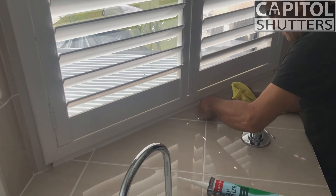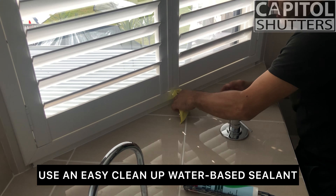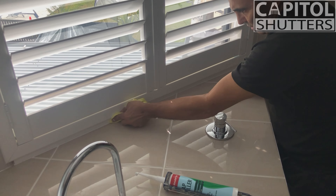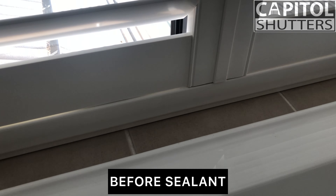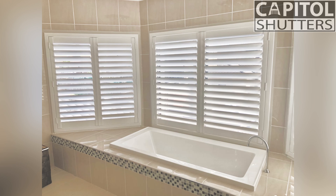I've installed all three shutters. It is my bottom packing piece — I'm going to put a bit of sealant there. I could go clear, or white, or just a colour match. I'm using a water-based sealant where you can clean up with water. There are some which are oil-based and they are very, very difficult to clean.